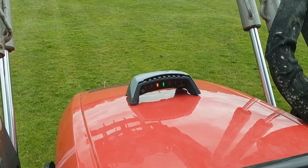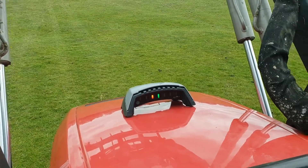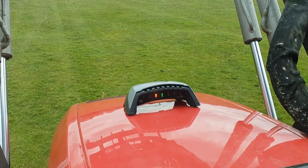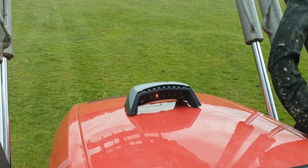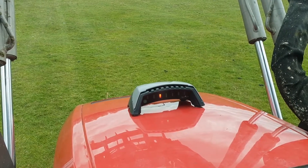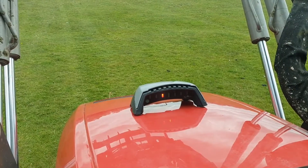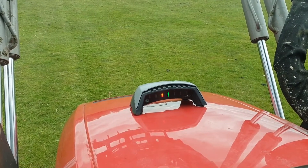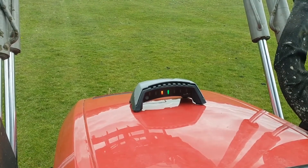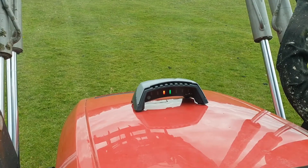All it has on the front of it is a power button and a series of LED lights. You have a green light in the middle — the green light isn't actually flashing, that's just some anomaly to do with the video on the phone. But when that green light is on with no red lights, that means that you're following your guidance line perfectly and you're nicely on line with where you should be. Once you deviate slightly off your line, you will get red lights coming on either side, and basically you steer away from those lights to bring the green light back on in the middle.